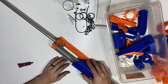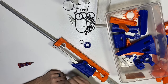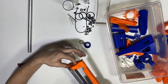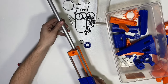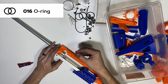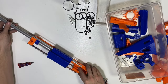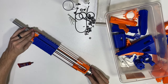There are a couple of ways to install the barrel. You could use the original clamping-style collet, which uses an O-ring and a collet to clamp it. If you feel that is holding too loose, you can also use a screw in the bottom hole — put a hex nut on the inside, then put your barrel in and tighten that screw to grab into the barrel. However, that can mar up or make marks on the barrel. So we'd like to send ours with the collet method pre-installed, but you can always add a screw later. Take your 0-16 O-ring, attach it to the barrel, take your collet and attach it to the threads. Then slide the barrel all the way down so it bottoms out into the upper magwell. Tighten the collet nice and hard so the barrel stays retained. Check the alignment — everything looks good.